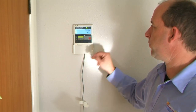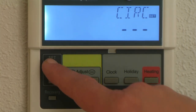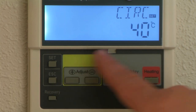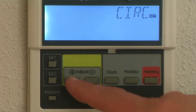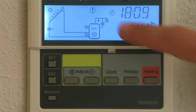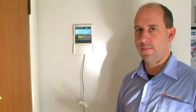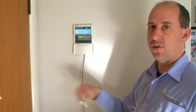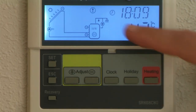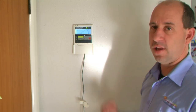Press escape to go backward and plus. This next one is also not normally used — it's a circulation function. If you've got a tap that's a long way from your hot water cylinder and you want to get heat down there so when you turn on the hot tap there's always hot water rather than waiting for the cold to come through, you'd run the circulation function. It requires an extra pump and an extra temperature monitor. You put a probe on the return line — if that gets below 40 degrees it will run the pump and keep hot water in the system. We'll turn that off because we're not using it at the moment.